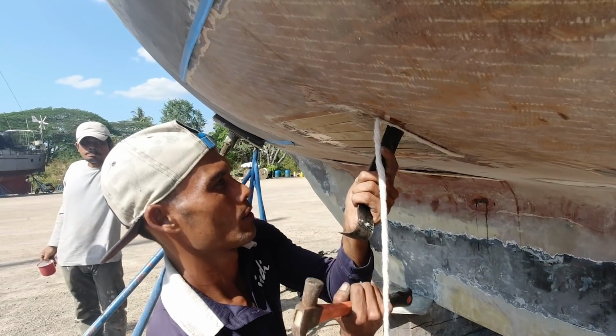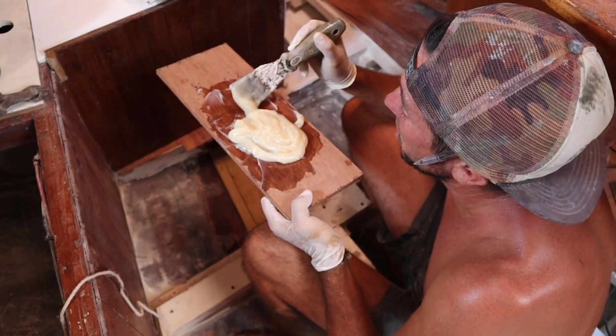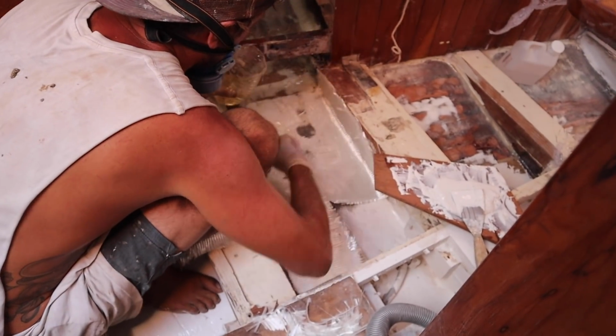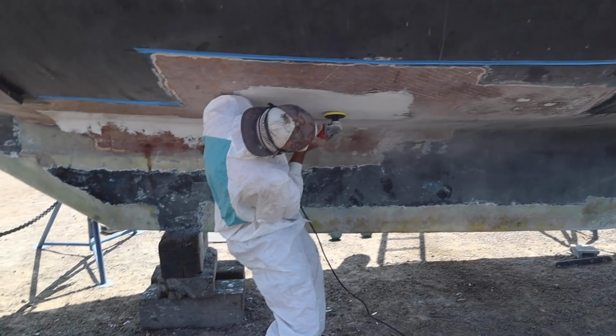Adopting a traditional way of caulking wooden boats, they tapped in cotton thread into each seam. Inside, I backfilled all the seams with epoxy glue and then fibreglassed over everything. Outside, the lads had covered their handiwork with an epoxy filler that once set, I got stuck into with the grinder to get it ready to lay more fiberglass.